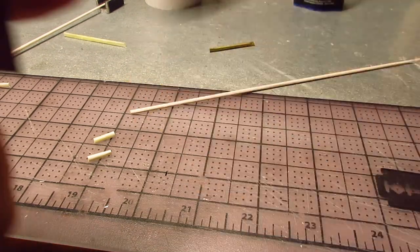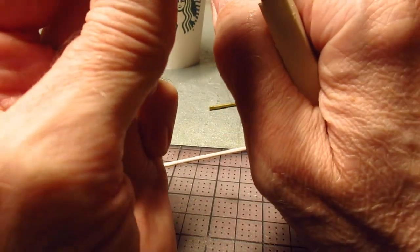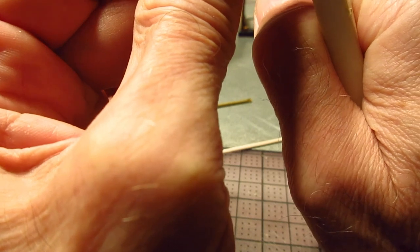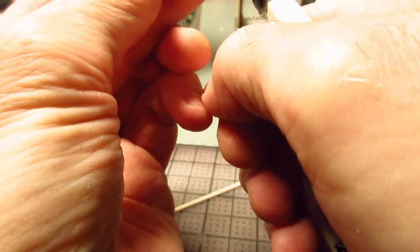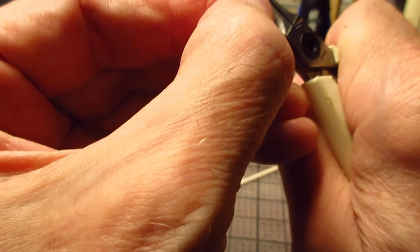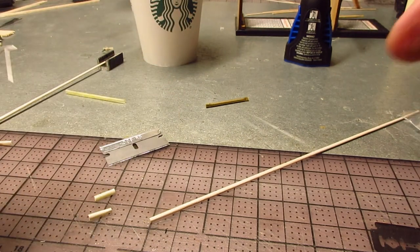I made the bend as shown before, then slid the razor blade in — I want about an eighth inch on the end. I grab it with pliers, make the bend, and can finish the rest by hand. Make sure everything's flat and straight. This is what I use to go into the tubing. It is better to do it in the top-hat bender, but you can do it this way — that's all I'm trying to show you. Make sure it's nice and square — that's important.